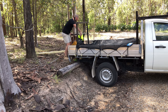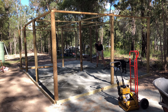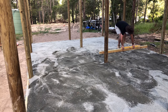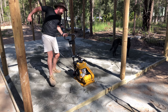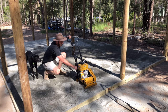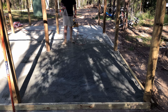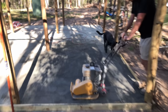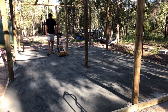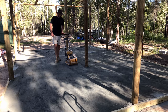Once I had all the material laid out, I rented a compactor — which I'd never used before, but I figured how hard can it be. I levelled it out with a landscaper's rake, finished it off with a level and a flat piece of timber to get it nice and even, and started up the compactor. The key idea is to let the compactor do the work for you. As it vibrates, each step it takes it will move a section forward and basically just walk itself around without you putting any effort in whatsoever. I also recommend wetting the ground — it makes it a lot easier to compact and also removes the dust that you stir up as you compact.